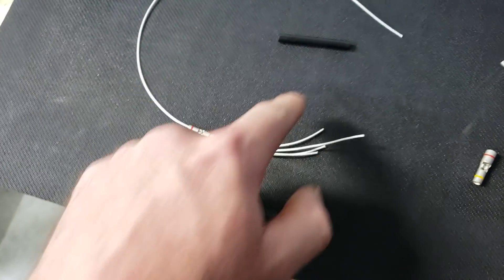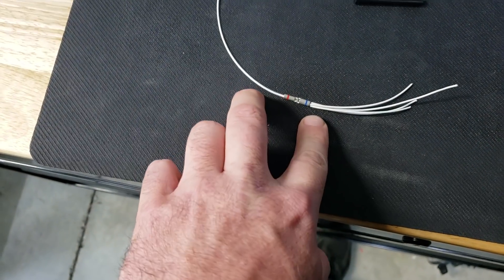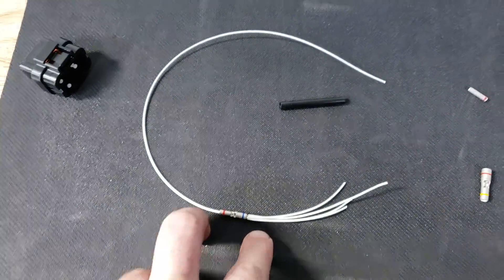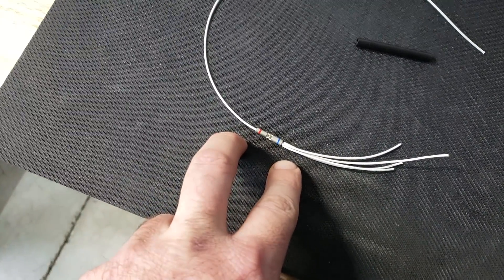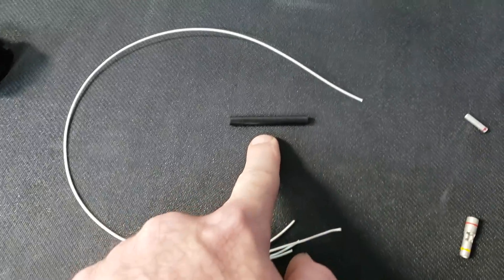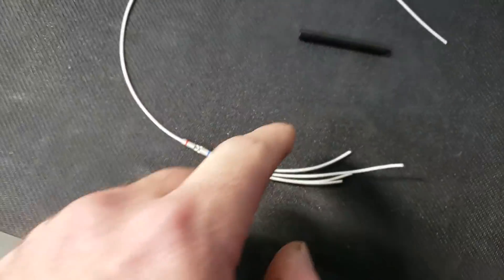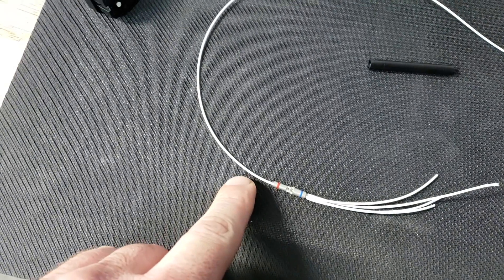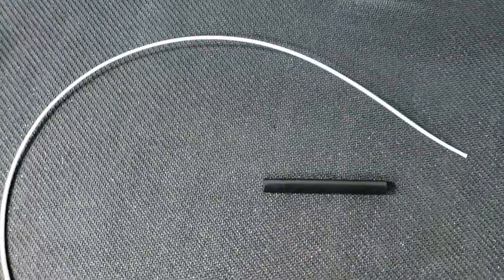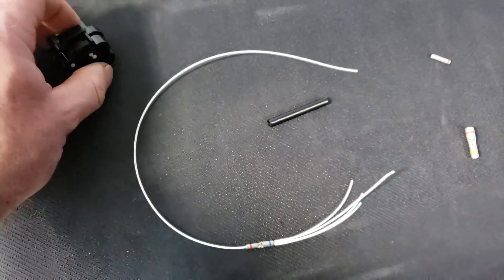The rigid SCL provides strain relief across both sides of the junction — so if you pull on the wire bundle, it's not pulling on one wire, it's pulling on the entire bundle, which is a lot stronger. That also ties into why I twist all of them together. Use a good adhesive lined heat shrink; the four-to-one shrink ratio is really nice because it'll be big enough to fit over all four wires but shrink down tight on the single wire. I always recommend a four-to-one dual wall adhesive lined heat shrink.